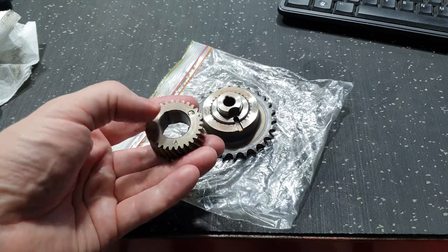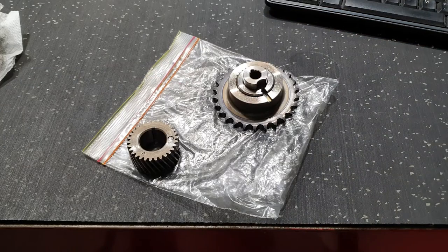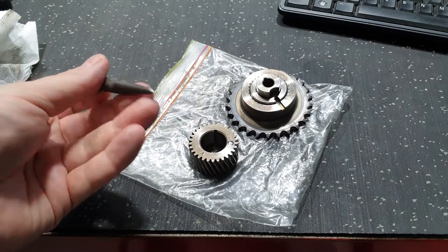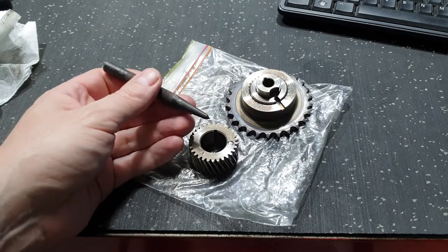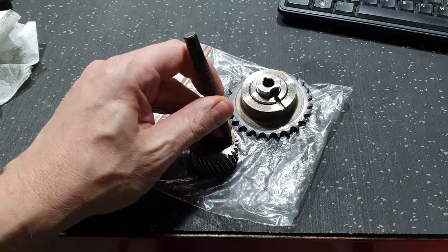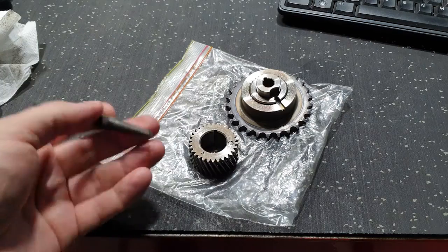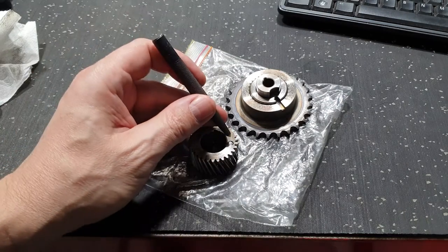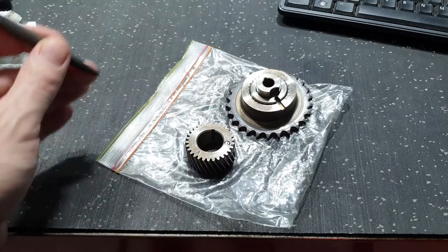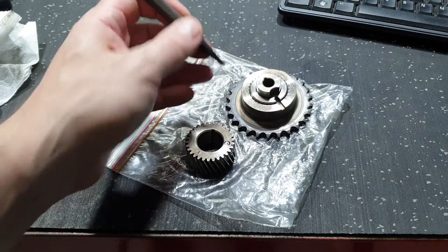Now, I'll hazard a guess that that pin is probably hardened steel, but there's one way to find out. So a quick test, at least what I know of anyway, is a centre punch to the pin in question. Hopefully somewhat in centre, if I can end up drilling this out. Just give it a little tap-a-tap. That is, it's actually softer than I thought. It's left a decent mark in there, which is a good sign, because that means I can probably drill it. Or have I spoken too soon? No, the tip's still sharp.